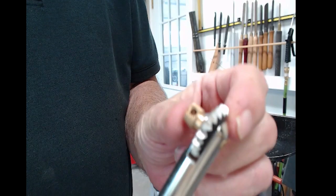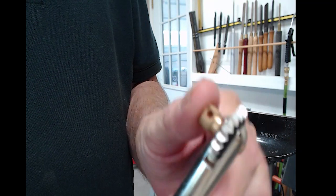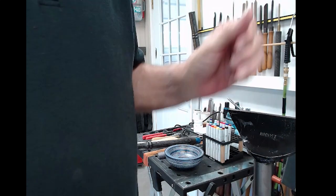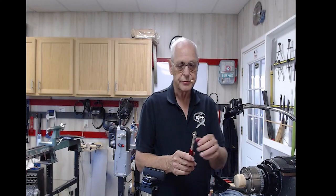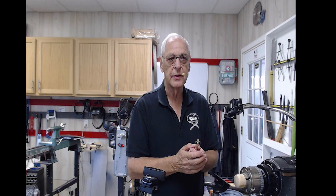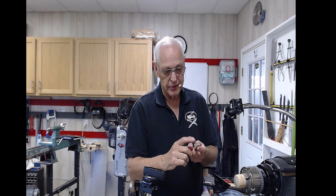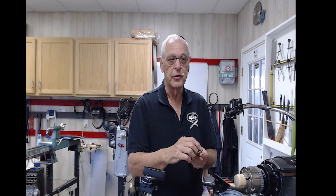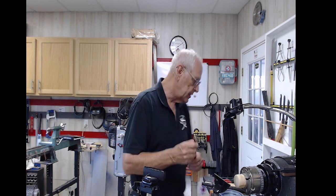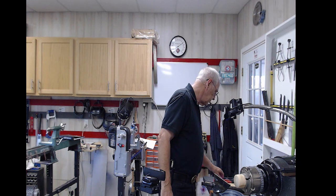but this knob is on the wrong side when it ships to you. It's turned around, and what happens is when you put this into the wood, it will unscrew the knob, which is very dangerous. So what I've done is take it out, turn the gear over, and put it back in so that the gear is presented the other way — then it won't untwist as it goes; it kind of locks it in.